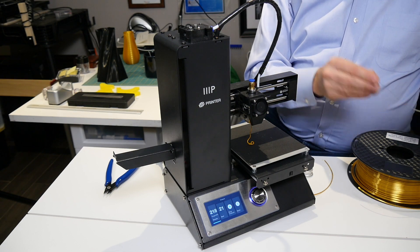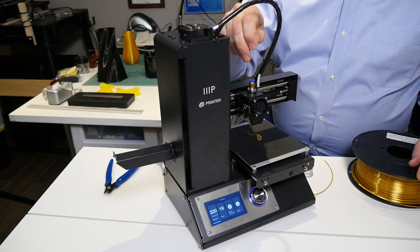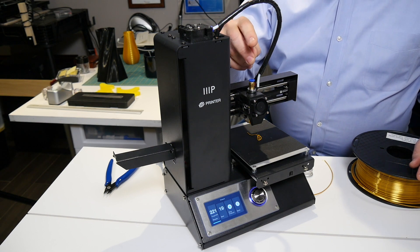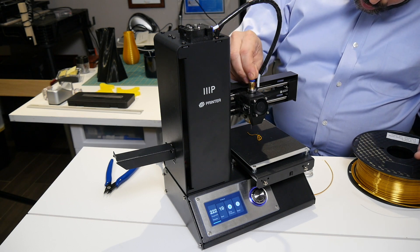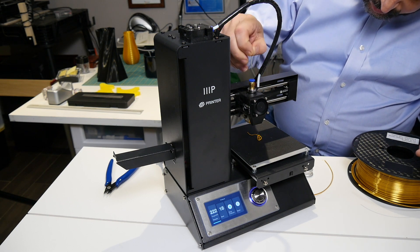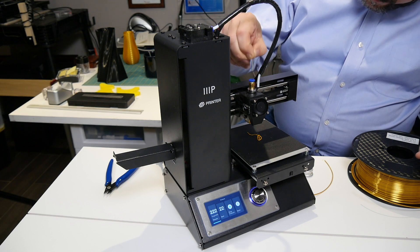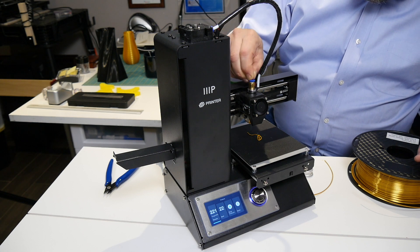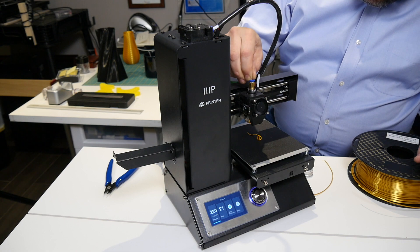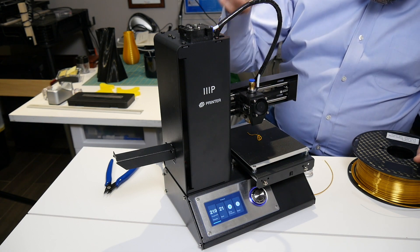In that case, I take one of the filament needles, I put it in from the top initially — and you need to do this carefully — and then I push it down through the extruder until you see the actual needle come out. I'll do that a number of times to make sure that it is relatively clear. I might twist it around a little bit, but I really work it up and down to make sure I can see the needle and it is clear.